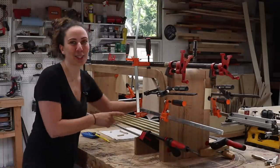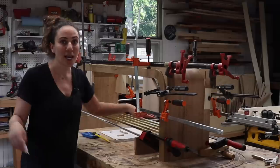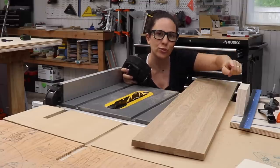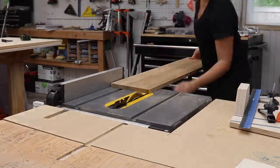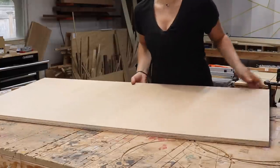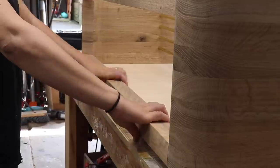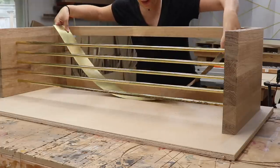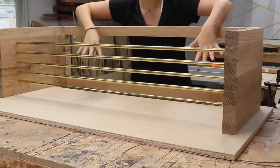I actually forgot to mention what I used to glue the brass in place. DIY Huntress is making a similar bench using steel tubing for a shelf — she goes into a lot of detail on how to do that, so definitely check that out. I want an eighth-inch reveal all around the storage lid, so now I'm going to trim off an eighth of an inch on either side of the lid. Now I can cut the lid to its final length. Moving on to the storage box — I took some cutoffs from the lid to use as spacers, moved the whole base flush with those spacers, and based the rest of the measurements off this brass strip that I'm going to use.